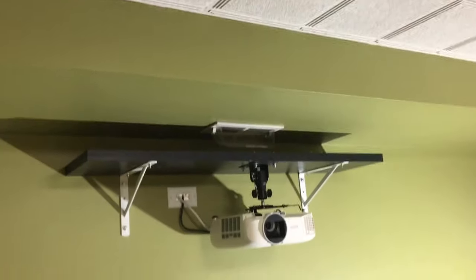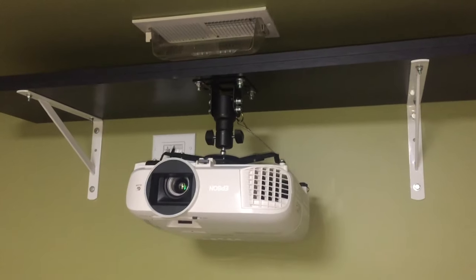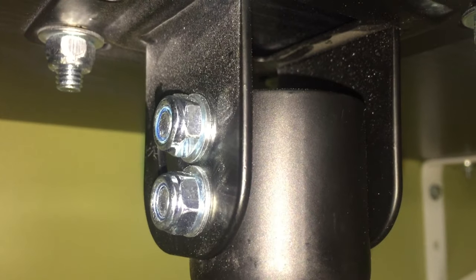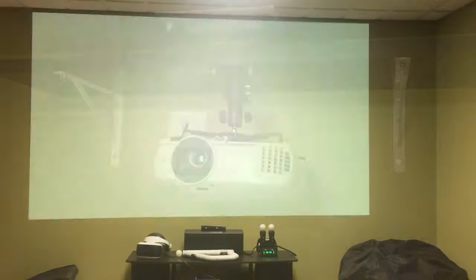As a mechanical engineer, looking at the brackets and hardware and thinking about the bending stresses and compressive and tensile strengths of these materials, this cracks me up. I've got heavy-duty brackets held in place with quarter-inch lag bolts — four lag bolts in shear and tension. The mounting bracket is held with four 5/16ths bolts in tension, and the lower part with two 5/16ths bolts in double shear. Then you've got these quarter-inch hand knobs, all connected to the projector with three little screws in tension. I suppose I'll trust the projector manufacturer that those are sufficient, because it's definitely the weakest link. There's also a security cable — if everything breaks loose, it'll hang by the cable, but it's thin. This whole system is mismatched and over-designed.